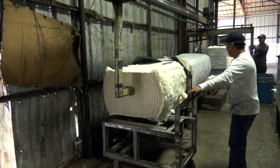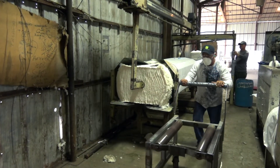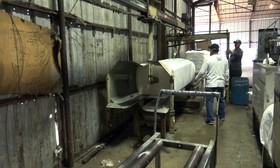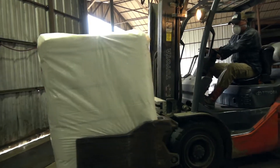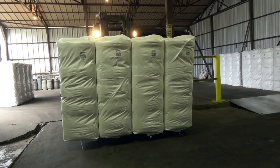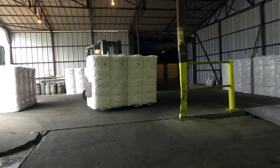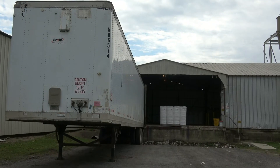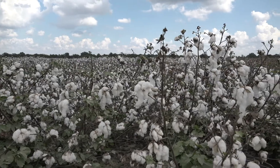May go up to 505 or 495. When we bale the cotton up, put the bag on it, put the permanent identification tag on it, take a sample out of each side of the bale and put the class card in there with it, and send it to USDA for grading. That's what the producer gets paid off of — what comes back from the USDA classing office in Memphis. Then we stack it in 88 bale lots and it is trucked over to Cargill in Memphis, and after that they send it to all the different customers they have all over the world.